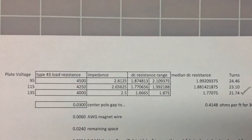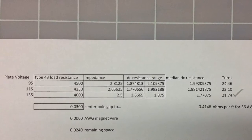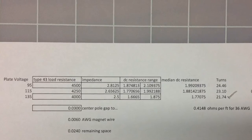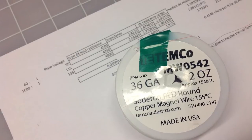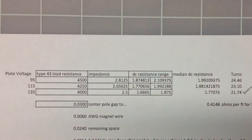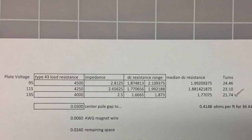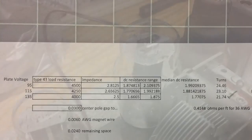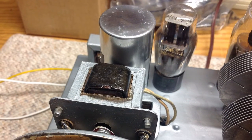With this information at hand, I decided to design my new voice coil accordingly. Doing the math, approximately 22 turns of 36 gauge magnet wire would be required for a total length of 52 inches — a much easier coil to wind by hand versus the 164 inches, and more importantly, this will provide a better match for the type 43 tube based on the turns ratio of the output transformer in the radio.